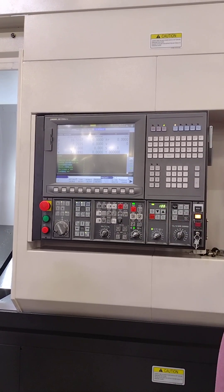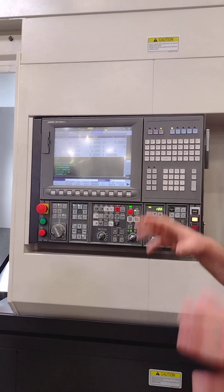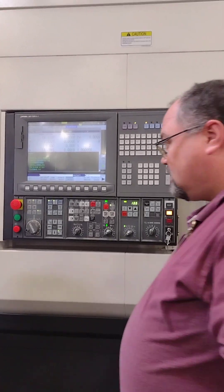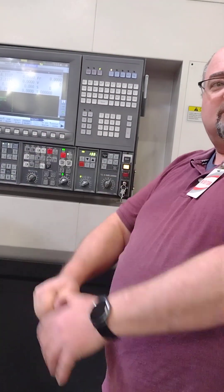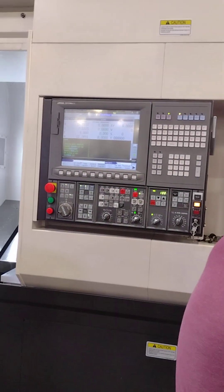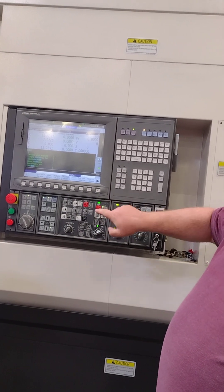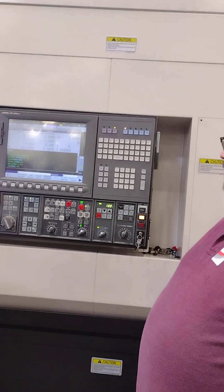You can get out of it by hitting the jog. What you're going to use is the spindle clamp. The spindle clamp is a brake, not the C-axis indexer. It's locked, it's solid, it's not moving. And if you did jiggle it just a little bit, you're on a brake — it's not reading anything, it's not going to rotate on you. So on this machine, only use the spindle clamp on both spindles for tightening and loosening bolts.